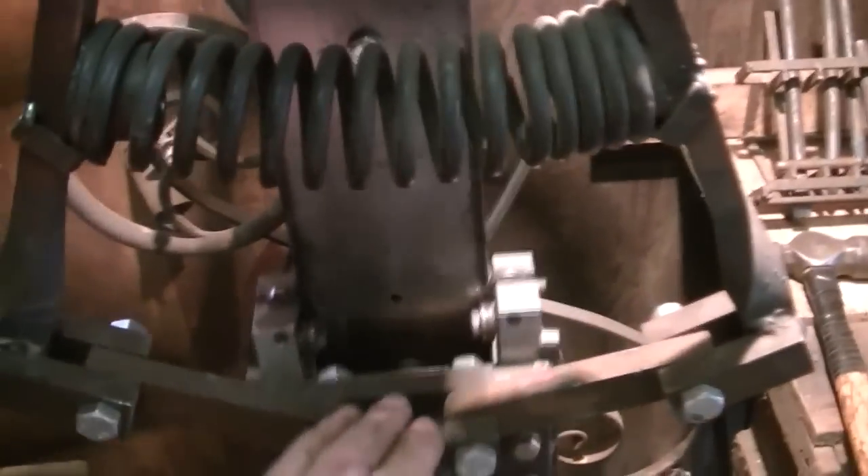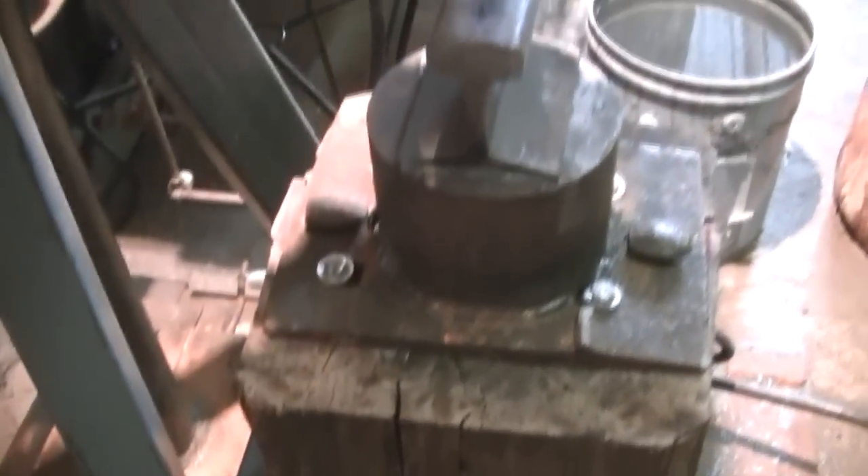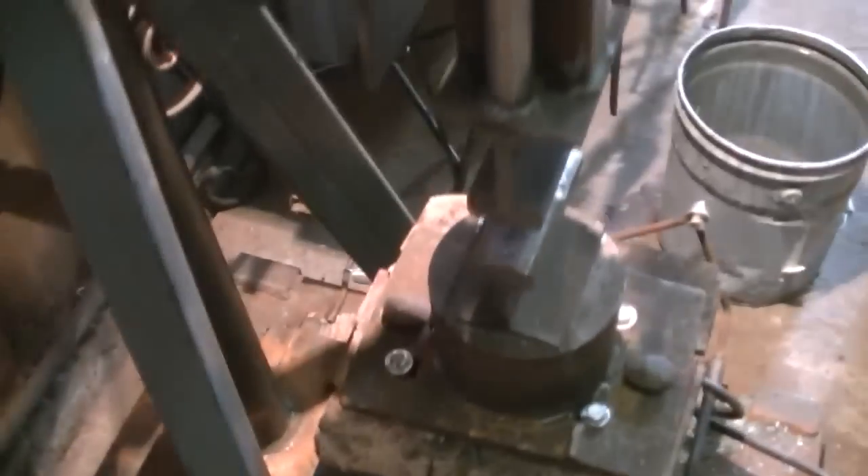The spring is off of an old Honda CB750, and railroad tracks for the hammer and anvil. The hammer and its assembly weighs 25 pounds, and I got a 12 by 12 section of old beam out of a building that the anvil sits on, on a railroad plate.